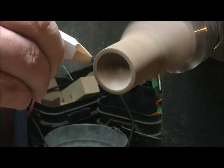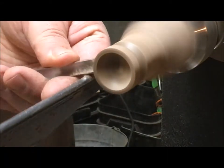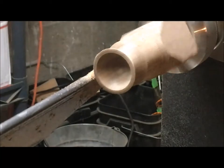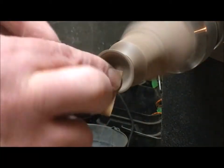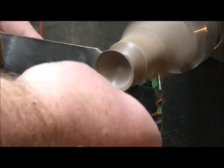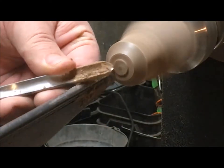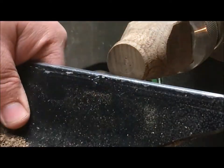And again the depth gauge — and you'll see my mistake in a minute. I actually cut right on the line, so I cut through the bottom and I didn't realize that until I parted the bowl off. After a little sanding we're ready to part that one off — and you'll see if you don't leave a little bit of space, we've got another one with a hole in it. Really, that's okay because there's still some wood left, so we're going to set up and do it again.